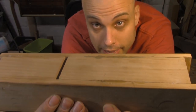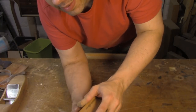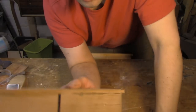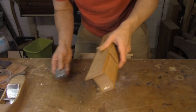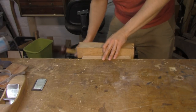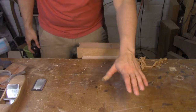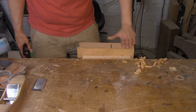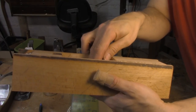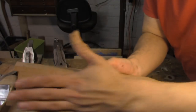Today is tomorrow — the plane is out of the clamps. It looks good. It's time to start cleaning the plane up. We're going to drop the iron in, flip it over, and check the projection of the iron. It glued up exactly the way I wanted it to. The iron is only an eighth to a sixteenth of an inch from being at the bottom, so I need to take enough stock off the bottom to get the front edge of the plane blade to start sticking through. The sandpaper-on-glass method will work great for this. I recommend having an 80 grit and a 100 grit. You might also do a fast pass with your table saw to get it down quickly. I've got the bottom of the plane down to the point where the iron sticks out of the mouth just a tiny bit — that's exactly what I'm looking for.